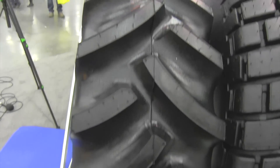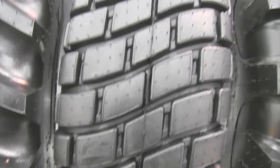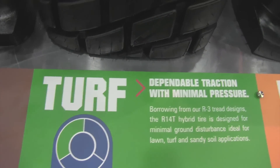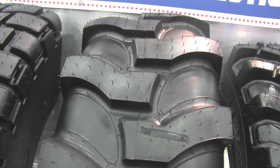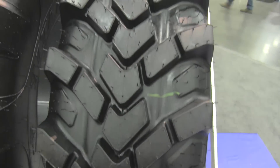Where do you see this tire going — is this going to be what we see on almost everything at some point? Obviously that would be nice. The guys in the utility compact and subcompact market, probably 60 to 65% go out industrial, because it kind of looks like a tractor tire and it's close — but there are conditions where it doesn't work. About 10% is ag, and probably less than 5% is turf, so turf is a small player. With that being said, if a guy went out and bought a tractor and put R14 on it, chances are we're going to hit 95% of those customers. The guys who are turf guys know they're turf guys — your golf course maintenance, the really precision turf applications. The tire itself, for an average acreage guy, is going to be quite soft for that application. Driving across a golf green, probably not. But that's kind of the give and take we've got on that.